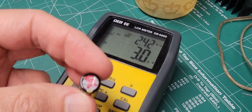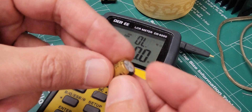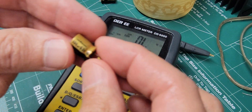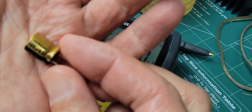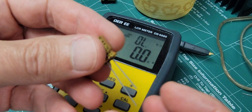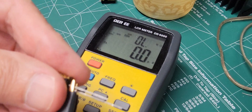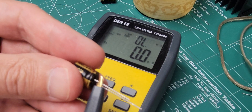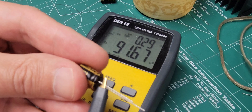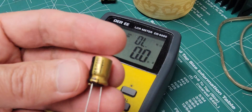To contrast, here is another 100 microfarad, 63 volt — brand new Nichicon. I want to show you what you're looking at for the ESR. It reads 0.29 ohms, and this is reading 91.6 microfarads, so this is definitely in spec — it's brand new.